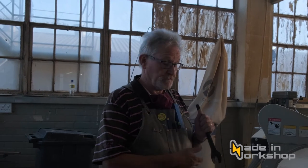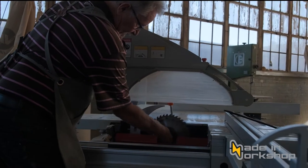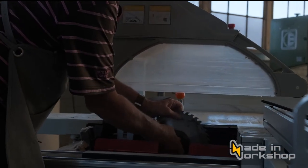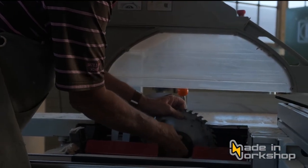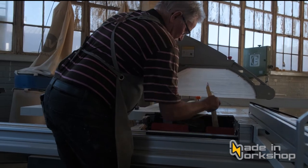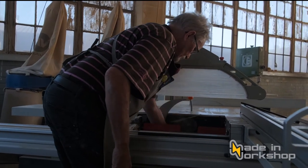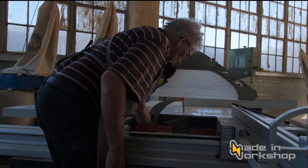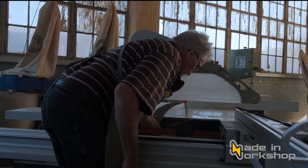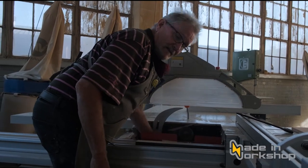The reason for the left-hand thread is because the blade locks as it's spinning in the opposite direction. So instead of undoing it to my left, I undo it to my right — and there I can take the blade off. The reason I'm taking the blade off now is twofold: it's not strictly necessary to change it, but I need to get some debris out. When the blade is in there it's not a good idea to do that, because you will nick your hand. With solid timber it's very difficult to get the chips to suck up into the dust extraction.